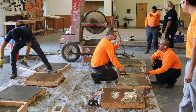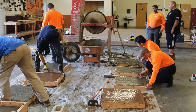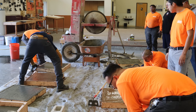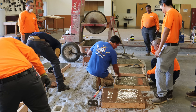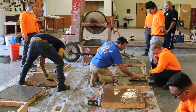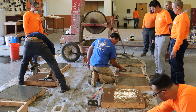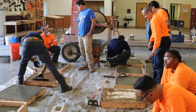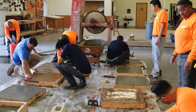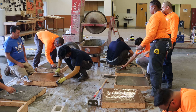We broadcast some color hardener on a couple of them. We have a couple of different colors — a smoky blue and a terracotta. Here I'm showing one of the students the edging procedure and how to hold the edger without rolling the edges and making them dip down below the form. We're using wood hand floats — 12 inch by 3 inch wide — and edgers with a half-inch radius. This is our initial lay down: just hand floating and edging.